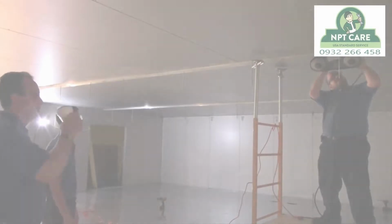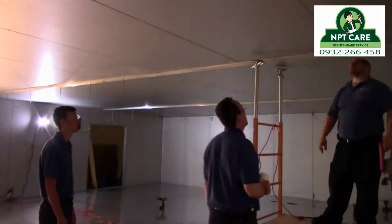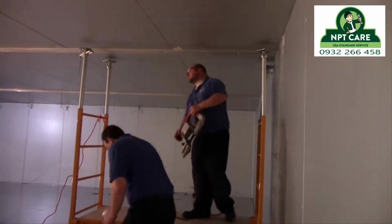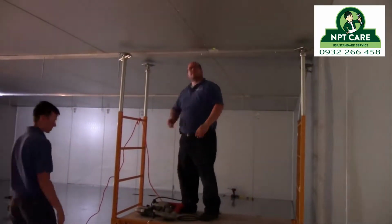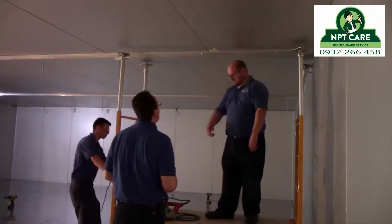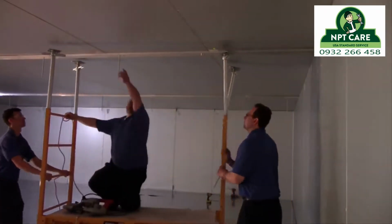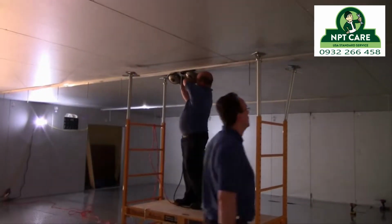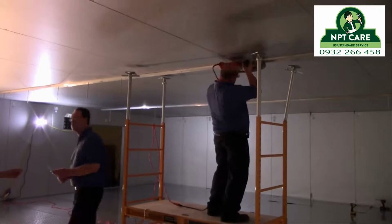We're just cutting the excess threaded rod off that's sticking out of that track. So we just cut it all off with the handheld bandsaw here, the Porter-Cable, and we just capped them off with a little brass finial that covered up the other edge, made a nice clean look, and also gave us something to act as a lock washer to basically double nut that thing into place.